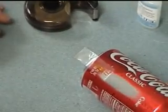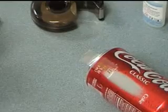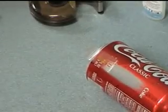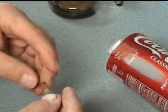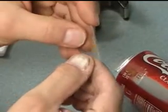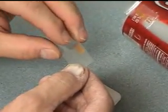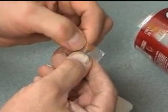Let that set for a minimum of one minute. At this point I would make a comment about the two sides of the strain gauge — very important to be aware of when sticking the tape to the gauge. Strain gauges have connections on one side. If you turn the gauge over, it's dull on the back. If you inadvertently glue it down dull-side up, you can't access the terminals. So you have to take the gauge off and re-glue it so the shiny side is up and you have easy access to the terminals.